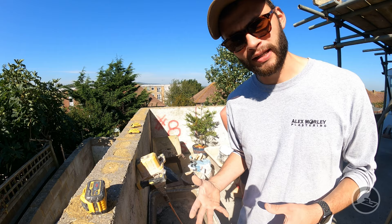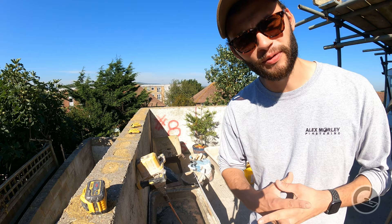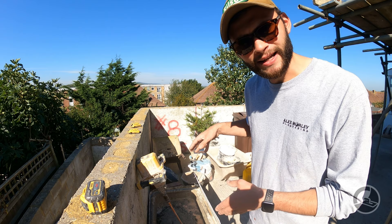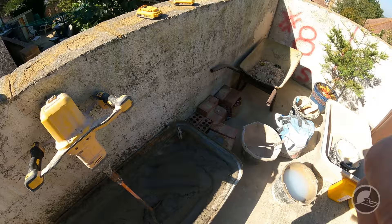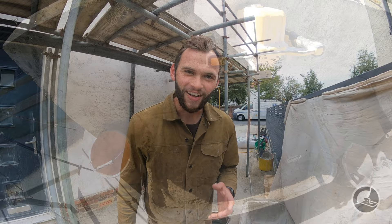A couple of things to remember with cement: it's really not good for your skin, so if you get any on you, wash it off straight away. It's also not nice to breathe in, so you should wear a mask. There's quite a draft here blowing the dust away, but it's good practice. We mix the cement through with the four sand while the other four sand is prepared and added. The render is now completely mixed up — it took about five minutes. It will be a very dark greeny-grey color because there's no lime.